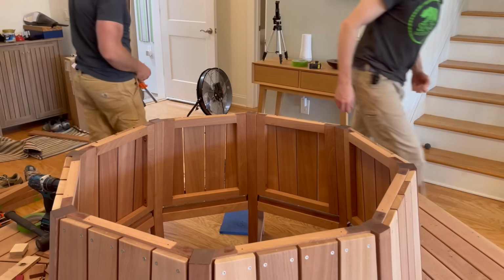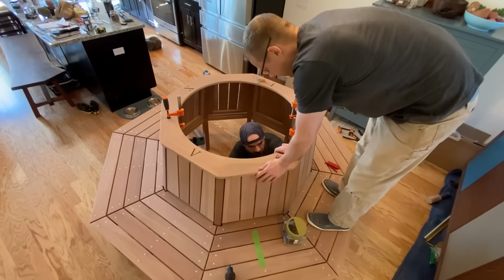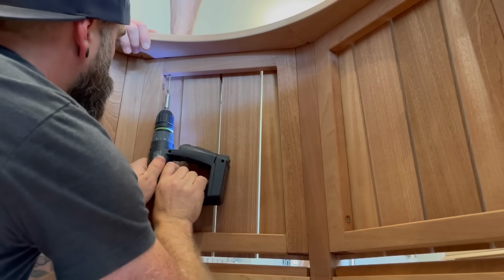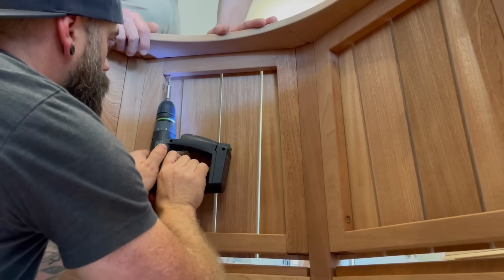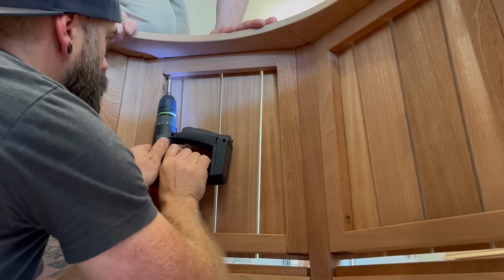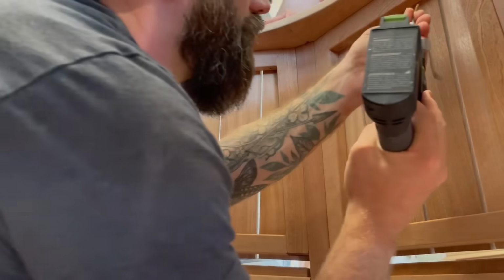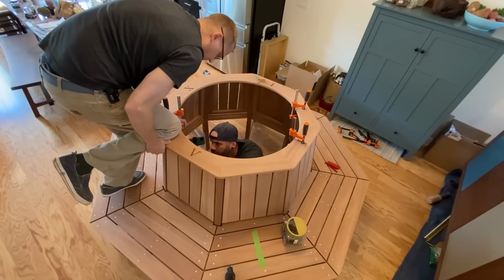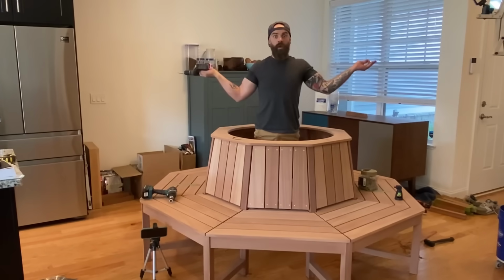And that was plop on our robot top. That's what I'm affectionately calling our octagon shelf crown thing. So I climbed inside the bench, and using those pre-drilled holes through each one of our frame assemblies, we sent some more fasteners up into the top. We thought about coming from the top down into the frame, but we just didn't think it'd look as clean. And what do you know?